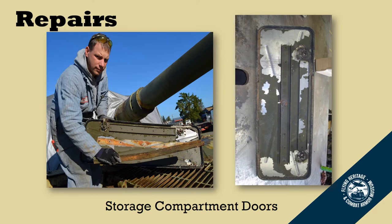The storage compartment box lids were made out of aluminum, and some of the channels that were riveted to the underside of the doors to reinforce them were damaged, so we had to replace some of that. Also on the turret, the driver door and the gunner door — all the hinges had to be repaired and those doors were also removed. There were also little fenders to straighten out, some compartment hinges were damaged and had to be replaced or repaired, and then there was some miscellaneous sheet metal work that had to be straightened out as well.